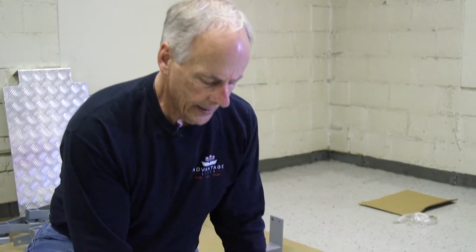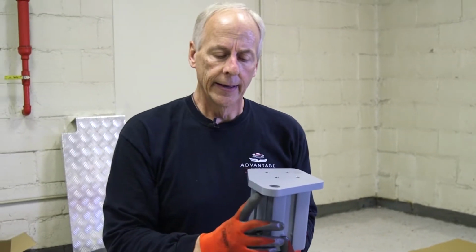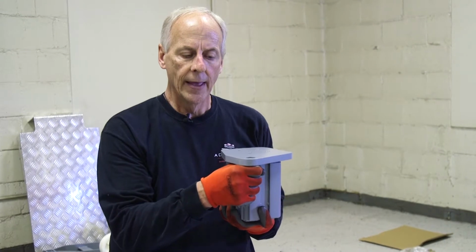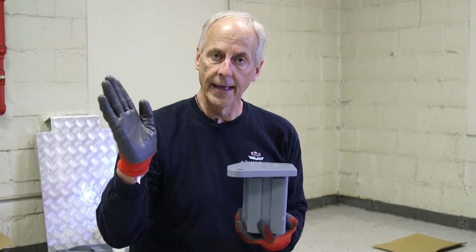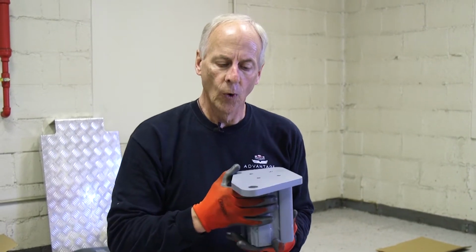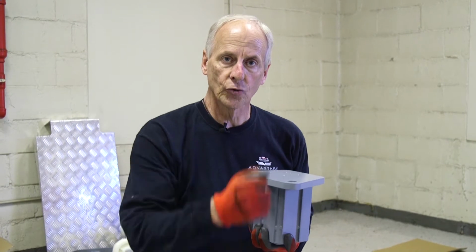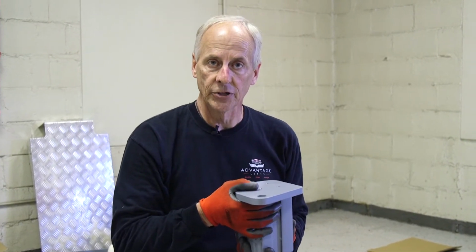It's very important that we put the right cap into the right post, because if I put this cap in at the wrong angle, it's coming off my pulley below, the cable's coming up, and it's over here, so now it's making the cable go off to a slant. That's not right. You want this to be straight up from the pulley that's on your cross arm, straight up to the top cap. That's another way you'll know that you have it in the right position.